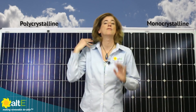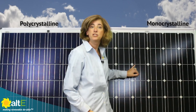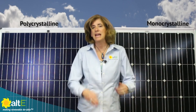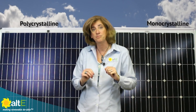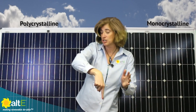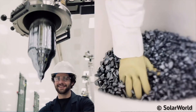A couple of things stand out right away with their appearance. This is due to how the solar cells, or the individual squares, are made. The monocrystalline panel is a consistent black or very dark blue color. It's cut into wafers from a conical silicon ingot that's been grown in the lab. To make the ingot, the silicon rocks are melted at 2500 degrees Fahrenheit, and then a seed crystal is lowered into the melted slush and slowly pulled up while rotating. It's almost like making a hand-dipped candle, but instead of melting wax, you're melting rocks.